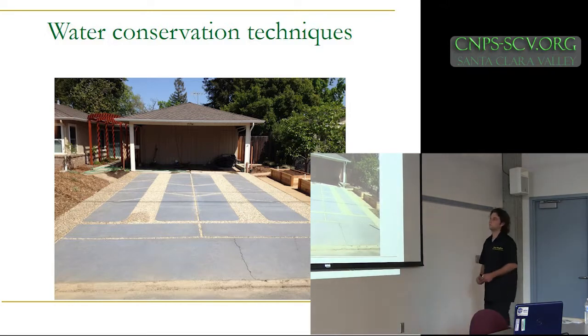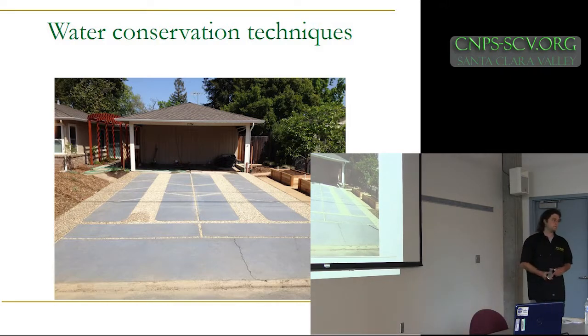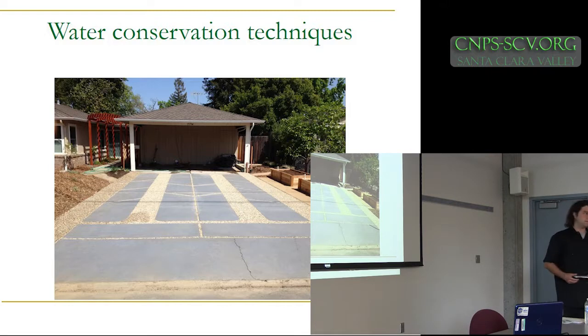So when you're cutting out a driveway, you're going down into the rebar? Yes, if they have rebar. Not all driveways have rebar. It depends on who did it, how good a job they did, when it was done, what kind of concrete they used, soil conditions, whether or not they were being cheap. So you never know if a driveway has rebar in it. You just have to figure it out when you start cutting.